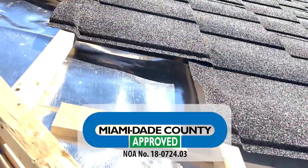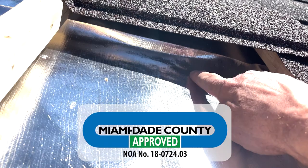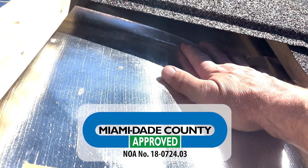The way this works is the roof is going to get hot from the sun, and normally it would radiate heat across this airspace and heat up the roof deck, because normally you'd use like a roofing felt or some synthetic type product.